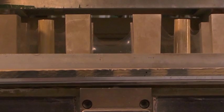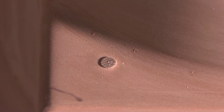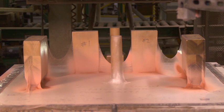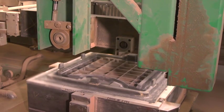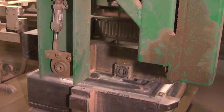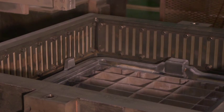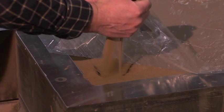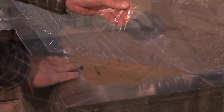The softened film drapes over the pattern with 15 inches of mercury vacuum acting through the pattern vents to draw it tightly around the pattern. The plastic film is now shrink-wrapped around the pattern. The flask is then placed on a film-covered pattern. The flask walls also function as a vacuum chamber. The flask is filled with an extremely fine unbonded sand that is packed around the pattern.